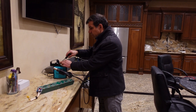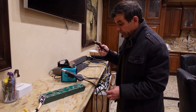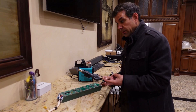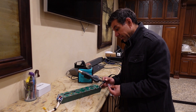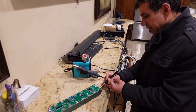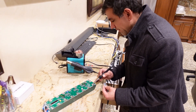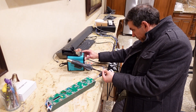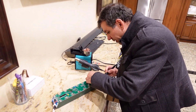I can't find any issues with the battery quite yet, but what I'm going to do since we're already all the way in there is remove the tabs from the BMS, check the battery again, and then just put on the new BMS. Everything seems pretty good. This might take a little bit - my soldering iron is struggling. Maybe I should put on one of my more robust tips.